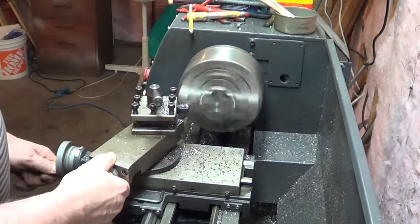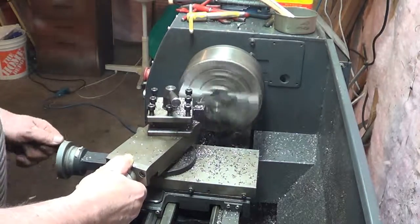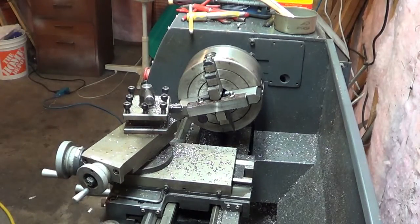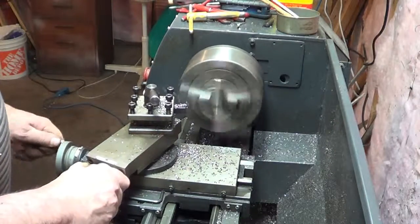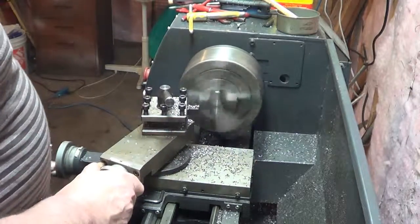I'm figuring that's because I used the chop saw to cut these pieces off and they probably got heated up and were harder there for some reason. To solve the problem, what I did was very carefully, a thousandth at a time, bring them down until they were smooth. That's why I was using the parallel to check it.